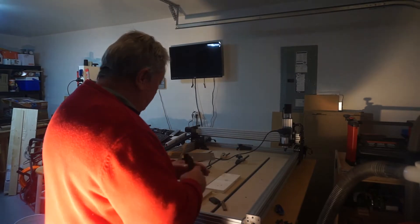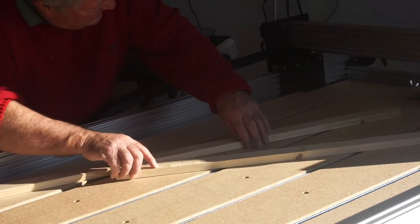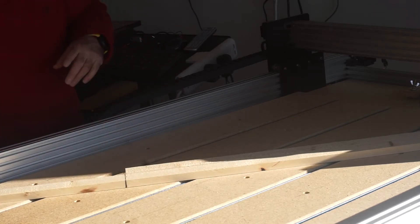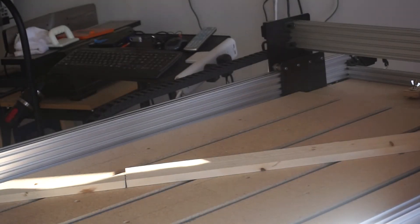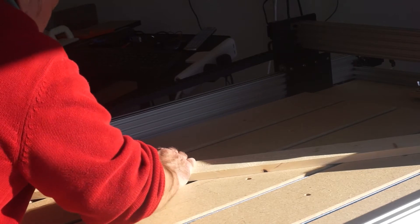So I believe I've found a resolution to this. This is an old trick we used at Whiskey Hill Woodmill, which was a cabinet shop. These are called story sticks. You can use any board — I just took a two-by-one-by-four and cut it in two. You have to put a point on each end so that it can get into the corner. You put that in there, make sure it's diagonal, and then you make a mark. Then you do it in the other direction, and if those marks line up, that's square.